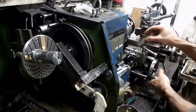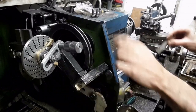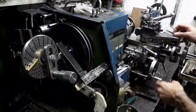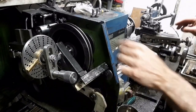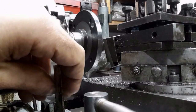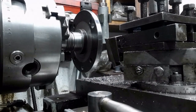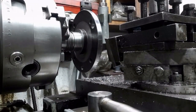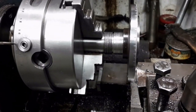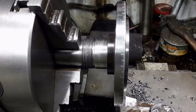I am using different sized spacers in conjunction with the carriage stop to limit the travel of the cutting tool. The lathe backplate is used as a reference so that the proper spacer is used for the tenths, fives, and degree divisions.